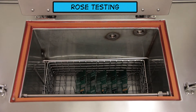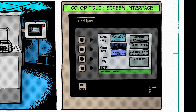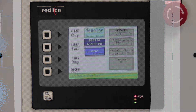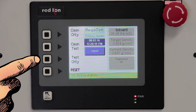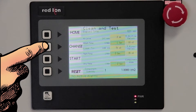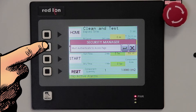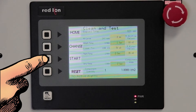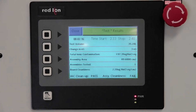After the wash cycle is complete, the cleaning solvent is purified by an ion absorption bed and filter to a programmed purity level. An ionic Rose cleanliness test can be initiated before the solvent is drained and the boards are dried. It has an easy touch screen program with modes for clean only, clean and test, or test only. After selecting the change button, it's security protected, so a password is required. Then you can enter the parameters for your boards and start the cycle. After the cycle is done, you see a pass or fail for the Rose test on the screen, and can view other process data archived for future reference.